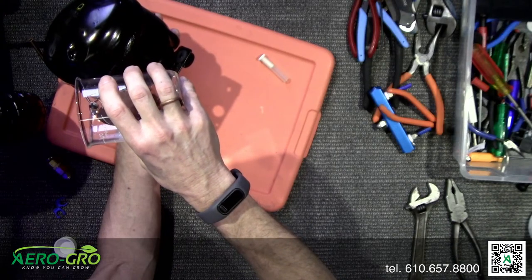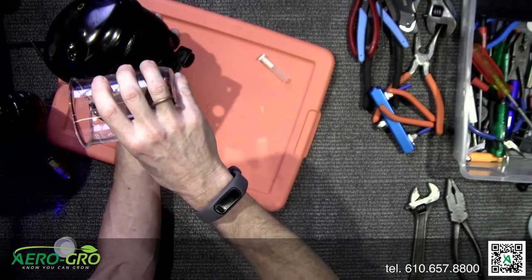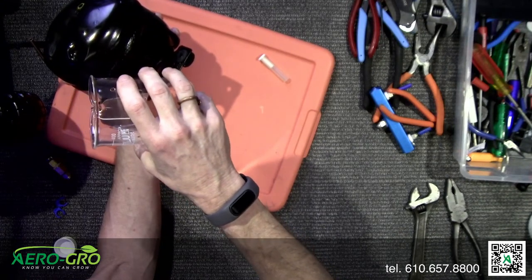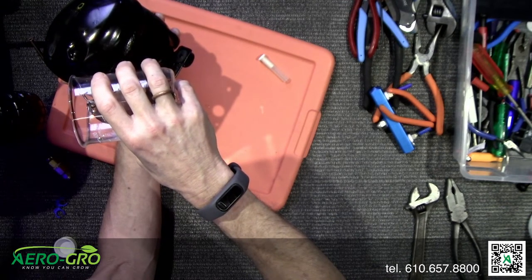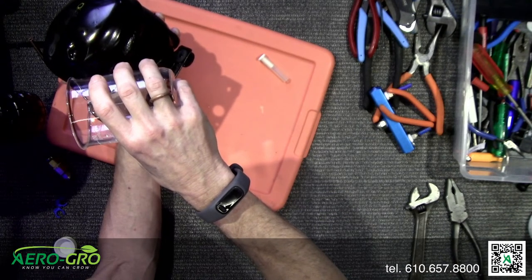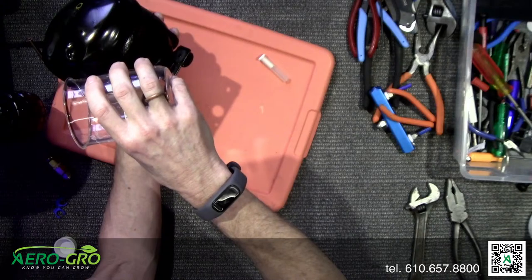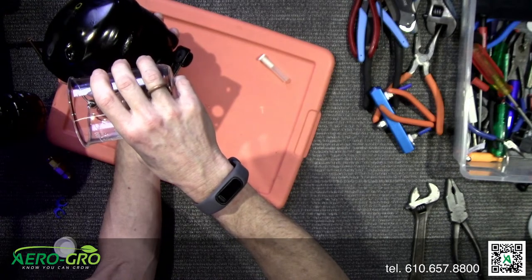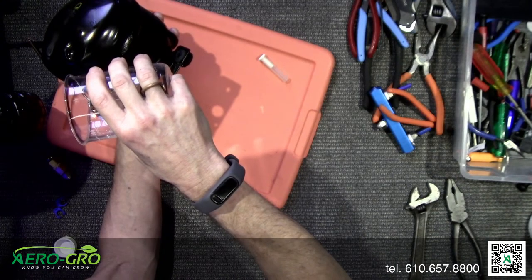Here's the other thing to keep in mind. With the tubing, especially when you're fitting tubing to these projects, there are two different things you have to pay attention to. There's the inner diameter, and there's the outer diameter, or the outer measurement. So ID and OD. Inside diameter is the opening inside the tube. Outer diameter is the overall diameter of the piece of tubing. So how open it is inside and how wide it is outside. Those are the two measurements. So you could have two different pieces of 1/4-inch OD, outside diameter tubing, but the inner dimension would be different. And that'll mean that the capacity for that tubing to carry liquid or water is very different, depending on the size. So something to keep in mind.